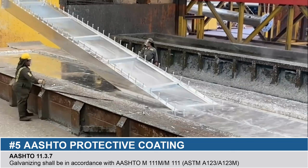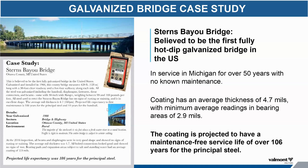Galvanizing to ASTM A123 means less than 2% rust ever shows up on that coating over a 75-year period, even in a marine environment. Owners are kind of trained that every 40 to 50 years they have to replace a superstructure of some magnitude. But because that coating will last 75 years, let alone the steel underneath, owners are often able to leapfrog that 40-to-50-year window and get a significantly extended lifespan. If you're unfamiliar with galvanization, there are other coating options, including a three-paint coat system or painting over top of the galvanization for even further extended lifespan.